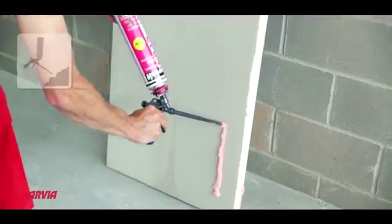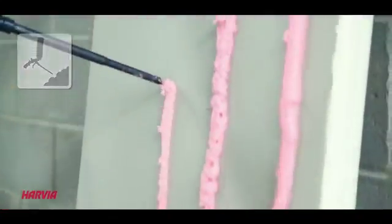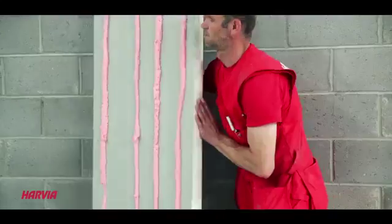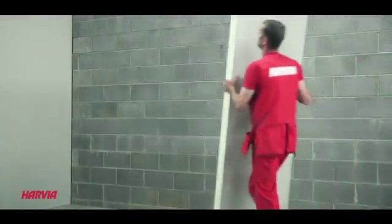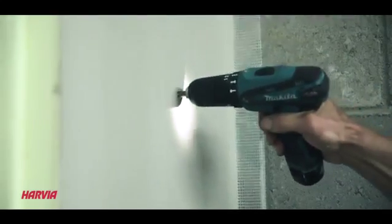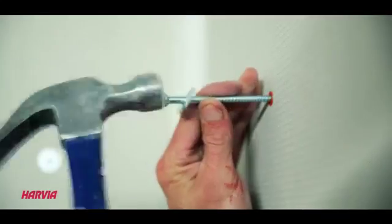Extra. Fastening to a room wall. Make sure the wall boards are straight before fastening. Apply foam glue on the wall-facing side of the board. Use nail dowels for stone walls and wood screws for wooden walls. Please note, use oversized flat washers to ensure the boards are properly fastened.